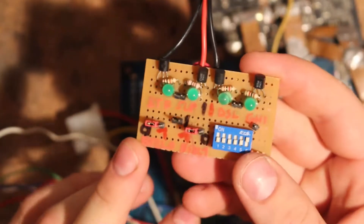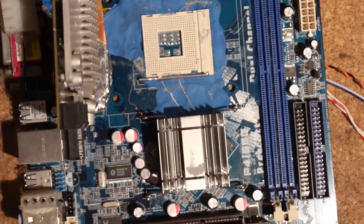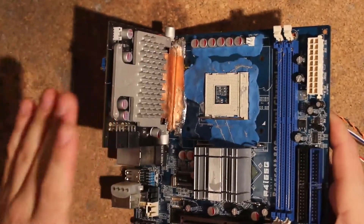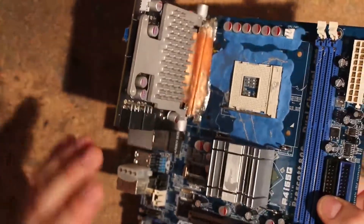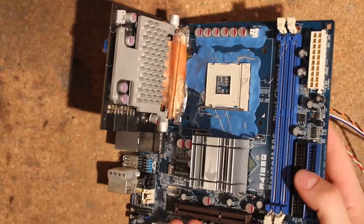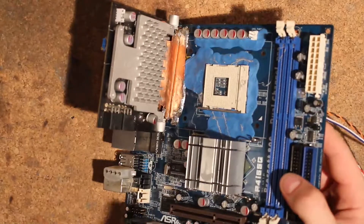The BSL mode is on here as well because I found it convenient. So from this ASRock board I kind of did a version two. This is just a bit of show-off of what I did here. When I did this I still thought the mod couldn't be done on ASUS because of the type of socket. But that's actually not too bad, because this board is still one of the only ones that runs the Prescott Pentium 4 mobiles at full multiplier - actually one of the only ones with DDR1. I also recently bought this one here - this is the DDR2 variant. You can see it's pretty destroyed here. I bought it with a broken VRM because ASRock makes cheap VRMs and power planes. But yeah, this is DDR2 and in theory should be better, but I haven't yet gotten around to e-powering this one properly.